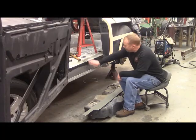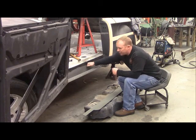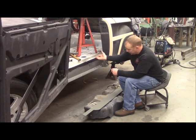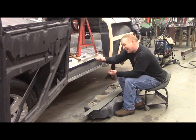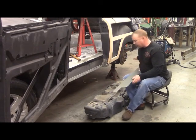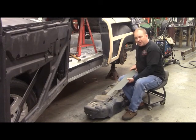Now, Bruce, I've got both these in place. I got them two-part epoxied, and they're on there extremely well. But I've got to put some back support in them, some gussets in there, and that's all sheet metal underneath there as well. So I'm going to put some 3/16 plate in there and make a landing. I went ahead and pulled the gas tank out to get it out of the way and get that fuel out of the way so there's no chance to blow this thing up. And then I've fabricated these panels.